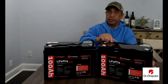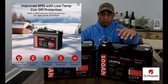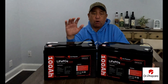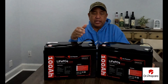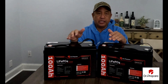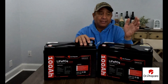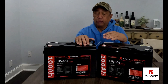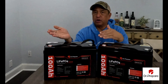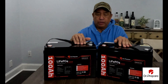BMS protection is a system to protect your lithium batteries from over-charge, under-charge, high temperature, low temperature, over-current, under-current, and short circuit. If any of those conditions are met, the battery senses it and shuts down to protect itself. The low temperature protection kicks in under 14 degrees Fahrenheit — it will shut the battery down and prevent charging. On the other end, if it gets over a certain temperature in the hotter range, it will also shut itself down.